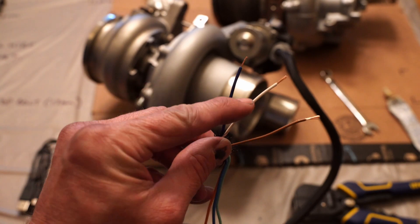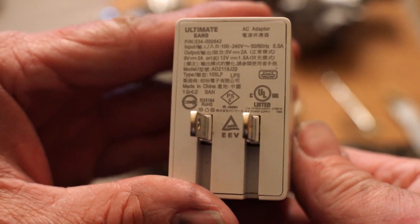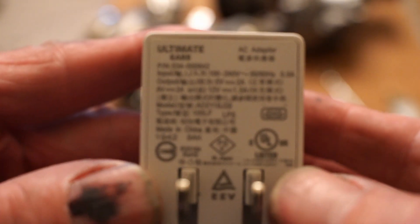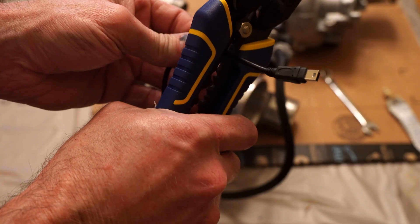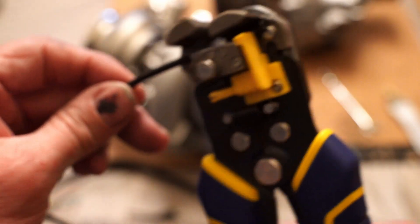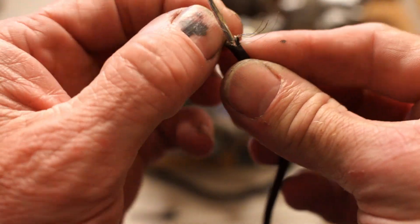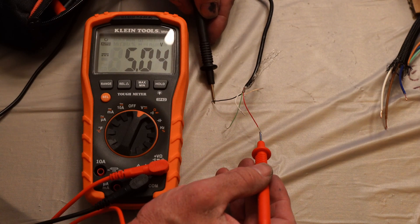Here's my wall wart — this is an Ultimate Ears headphone adapter. Basically what you're looking for is that the output says 5 volts at whatever amperage, 2 amps, whatever. The amperage really doesn't matter for this process, but the output needs to be 5 volts — a regulated 5-volt power supply. It uses a USB cable, so I'm going to sacrifice an old USB mini cable. I'll strip this down to the point where I have the positive lead and the negative lead. I don't need the other wires — those are data wires. The red wire and the black wire give me 5 volts, positive and negative. And as seen with my multimeter, I get 5 volts.